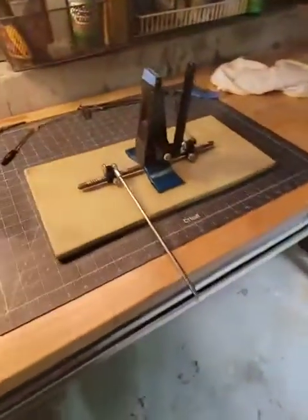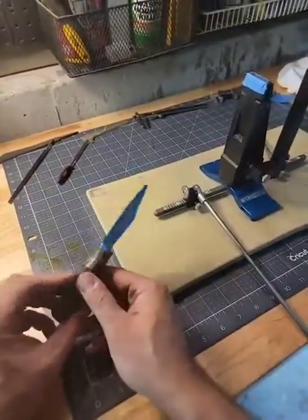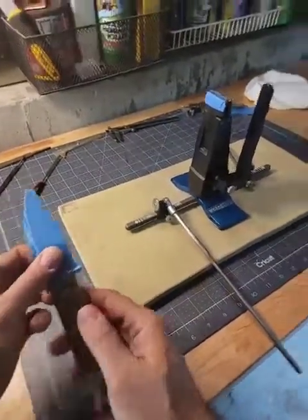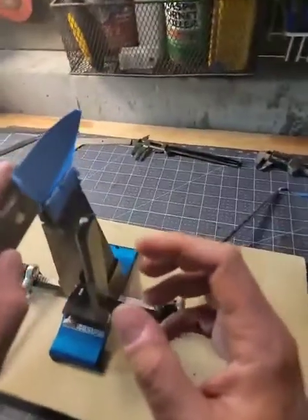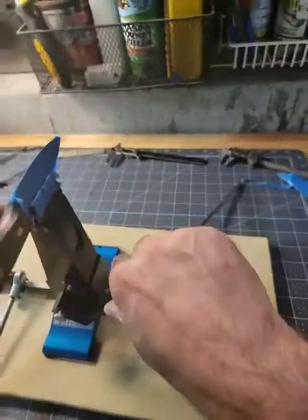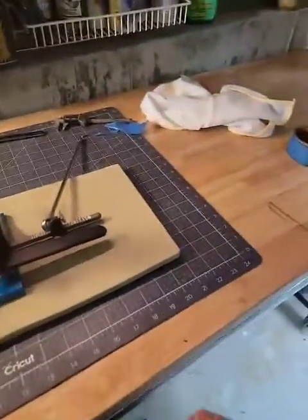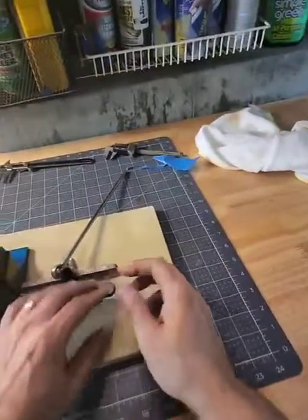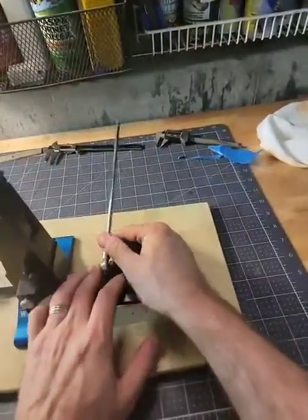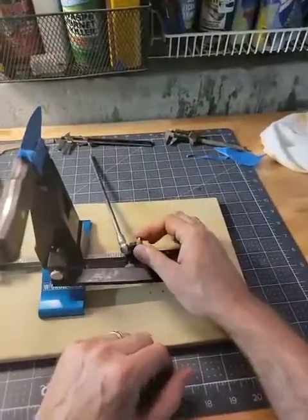So this I'm preparing to put an edge on, and I don't want to damage the Damascus, which I etched with acid. So I'm just going to finish it off. Maybe you'll enjoy watching it. And since it's a pretty thin blade, I'm going to, actually, no, I'll keep it there at around 21 degrees. I think it'd be okay.